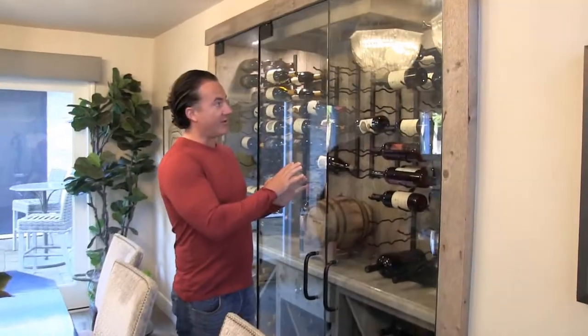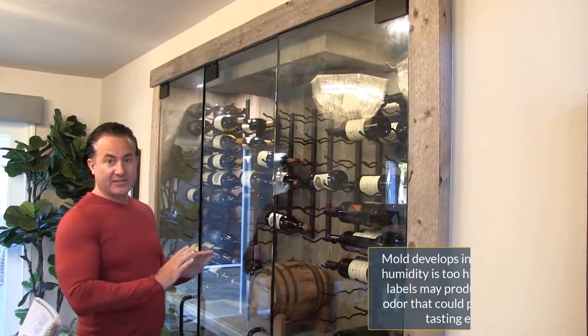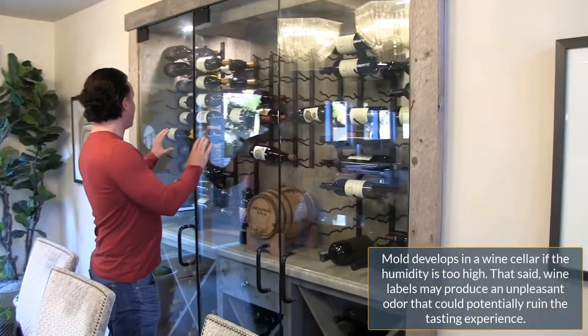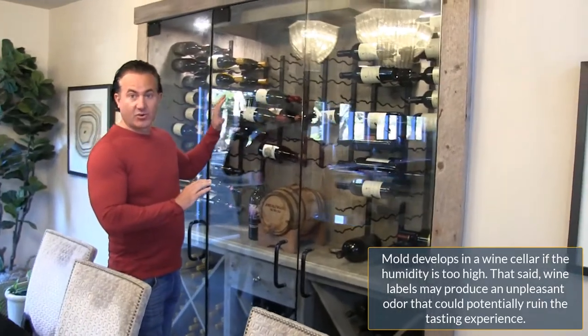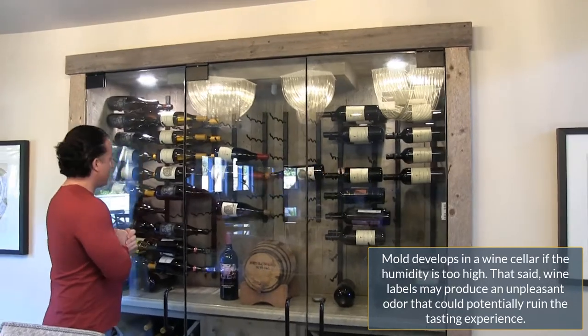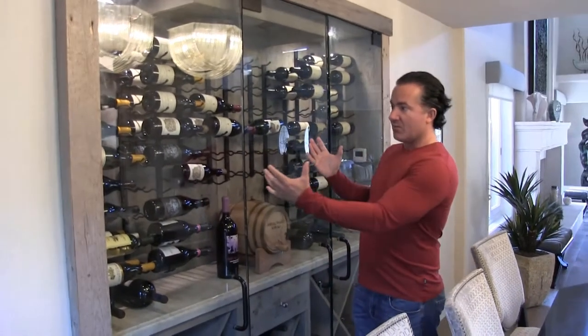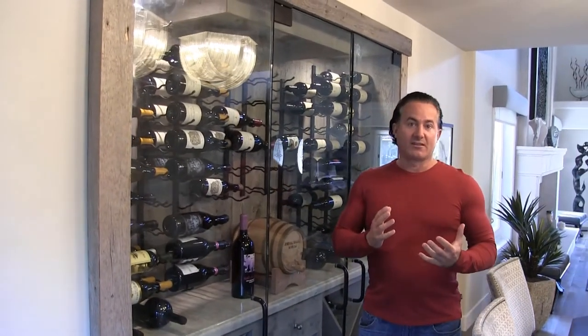When we first came into the house, this was probably one of the worst cases of mold I've seen — the bottles were actually green, completely molded, and all the labels were completely molded as well. We identified air gaps and what's called a hot wall: in the back of the house there's a wall that gets sun on it almost every day, which was causing those air gaps.